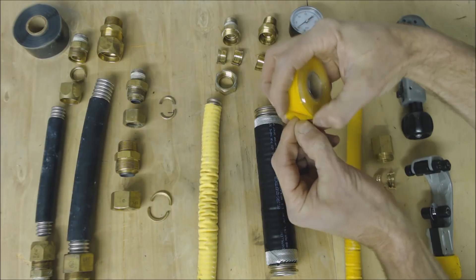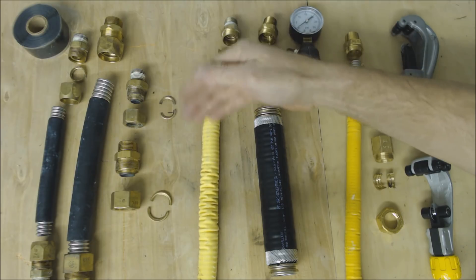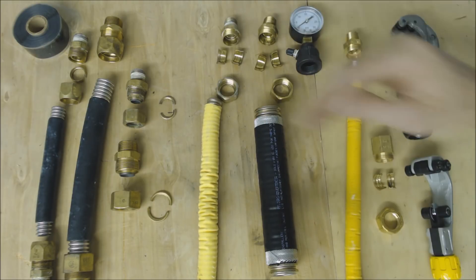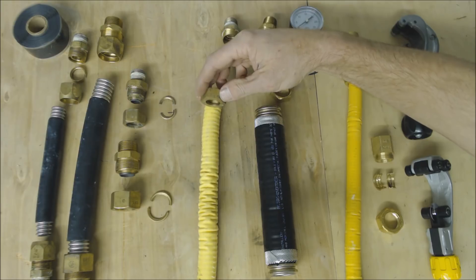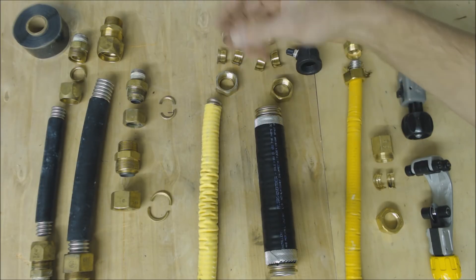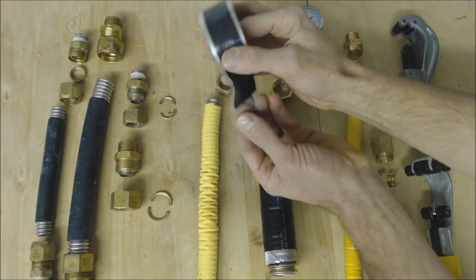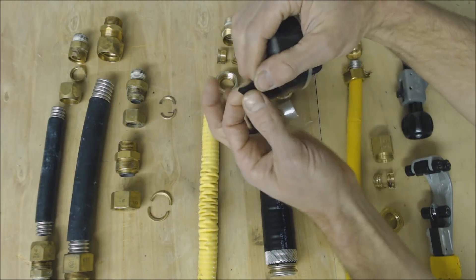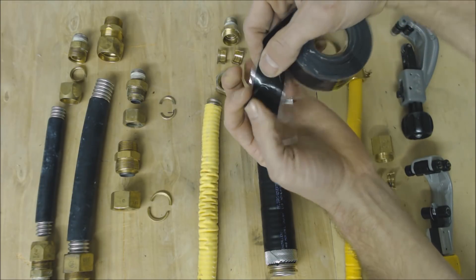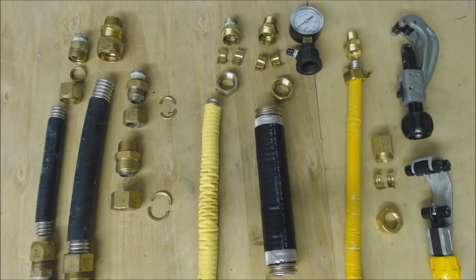This is self-fusing tape. Your training rep might say you can seal off the ends with self-fusing tape — if you have any tubing left after a cut, here's where your nut is, and you can wrap the self-fusing tape from there over to your nut. GasTite always likes the plastic more toward the inside. This self-fusing tape sticks to itself — it's not sticky to the touch, but if you press it together, it bonds pretty well.